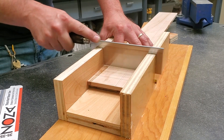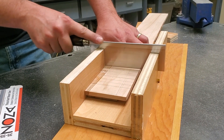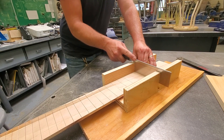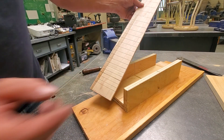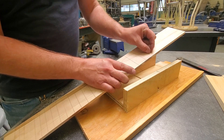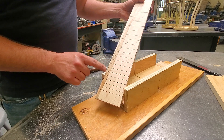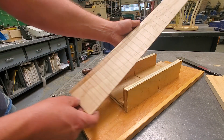This one is actually a little bit sharper. Now I'm going to get the depth of them exactly set. That slot is going to be for the nut — about an eighth of an inch to fit my bone nut. And counting: 1, 2, 3, 4, 5, 6, 7, 8, 9, 10, 11, 12, 13, 14, 15, 16, 17, 18, 19, 20, 21 fret slots — and that is going to be for a 25.5-inch scale length.